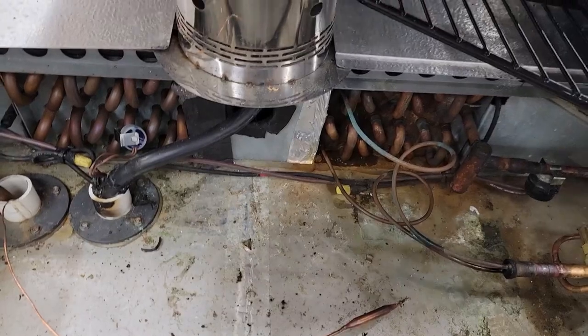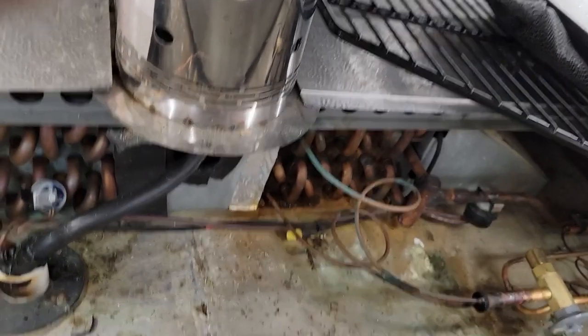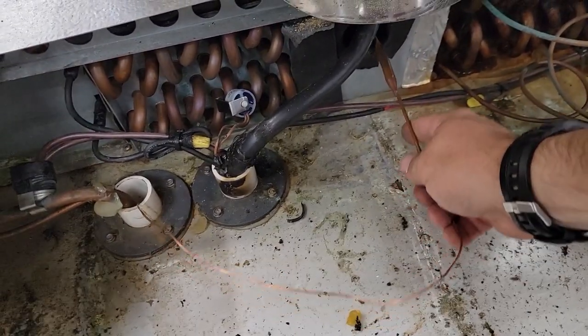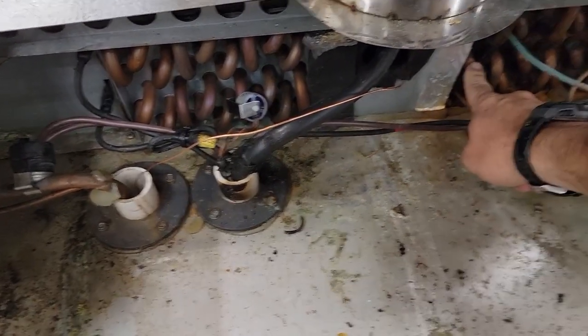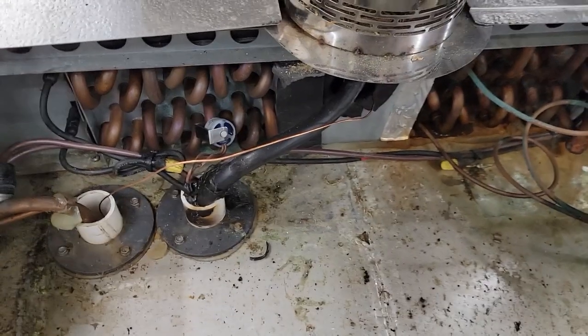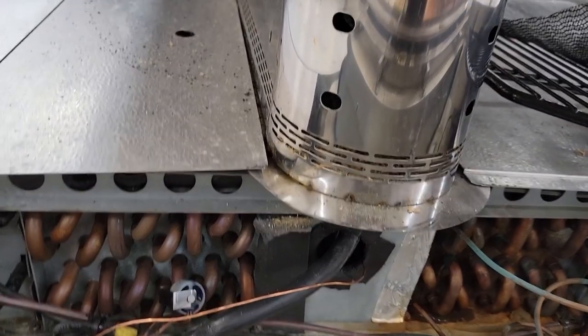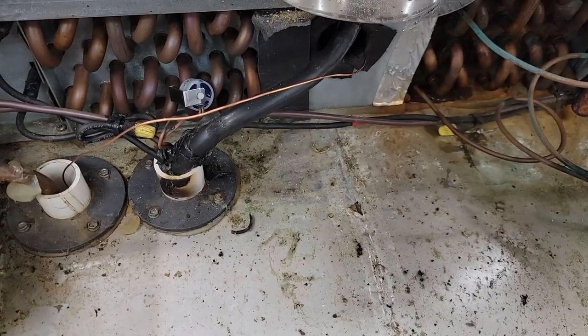There's the evaporator coil. If you think about it, your temperature is always 10 or 15 degrees off based on how it's built — the temperature coming into the coil would have to be lower. But if the bulb is laying up against one of these coil fins, that would really throw it off. It'd be better to get it a little further up in there, but that's where it's going to go.